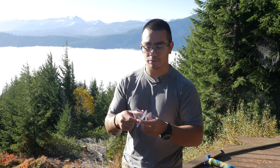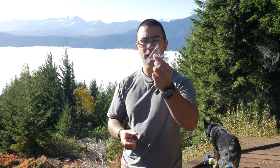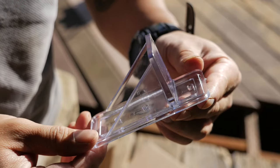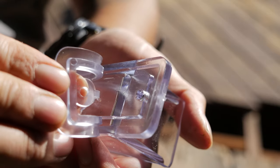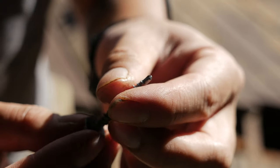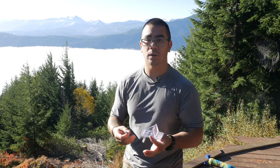There are a lot of different styles out there, but the one that was easiest to install and made the most sense was this one made by Snow Guard. They come in boxes of 50 and are basically UV-treated polycarbonate angle brackets. It comes in three pieces: you have the gasket which has a channel that locks in, and then a bag of neoprene washer screws that are self-tapping. I decided to get this because I didn't want to deal with a caulking gun up on the roof.